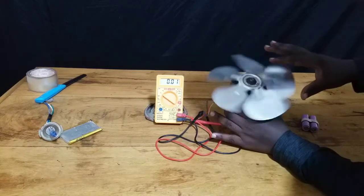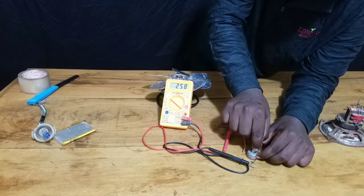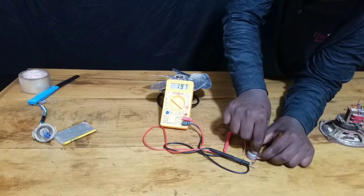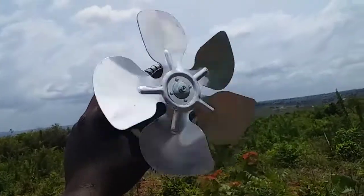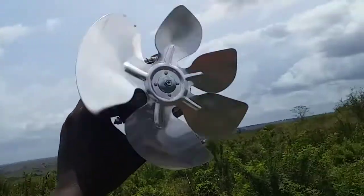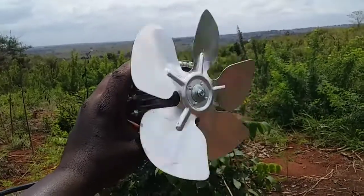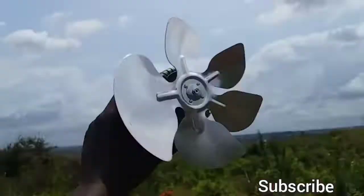There is no permanent magnet in the AC fan — it's just residual magnetism. Unlike the DC motor, which has a permanent magnet inside, and that's why, despite its small size, rotating it around the coil produces electricity. That's why you cannot use an AC fan as a generator. There are a few AC motors that contain permanent magnets, but not many. In the next video I'll explain why most AC motors don't come with permanent magnets and how you can convert an AC fan into a generator. Subscribe and check out the next videos!